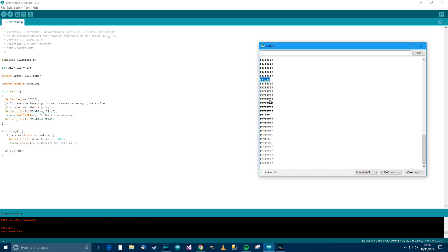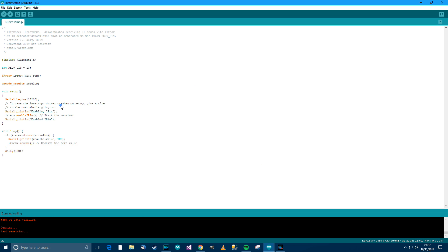So if you're trying to turn something on, you'd look for that code. When you find it, make your change, and basically ignore everything else until you find the code for switching off or whatever. Anyway, I just thought I'd quickly show you this — that's how to wire up the IR sensor to the ESP32, how to install the library, and how to get it working. Hopefully you found this video useful. Thank you for watching. Bye.